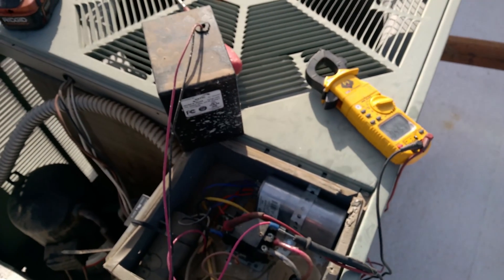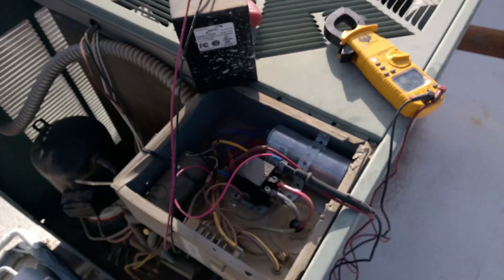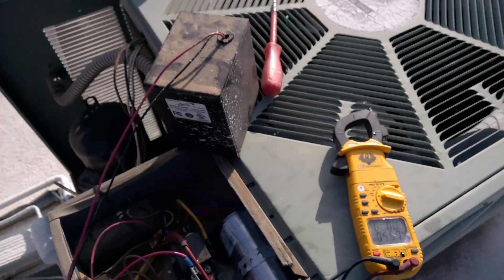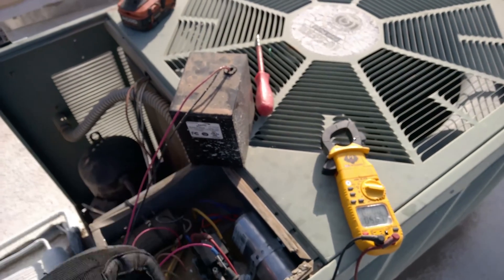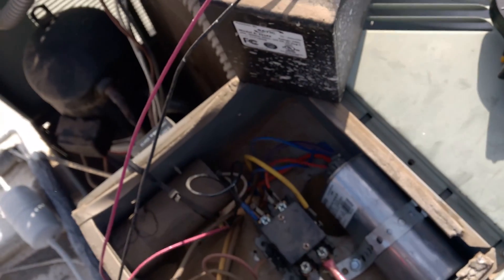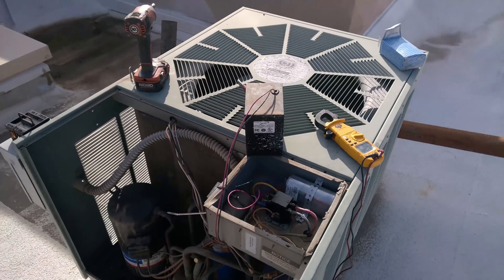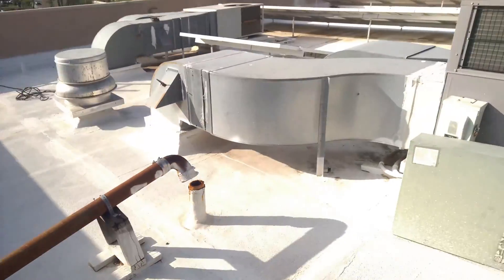Now another thing I did, now that I'm back here to finish a repair, is this thing that I was kind of thinking was a power factor correction gimmick or whatever. I believe that's exactly what it is. I have my capacitor checker hooked up and it says it's about 56 microfarads — you're not going to get a reading like that across something else. So I'm pretty sure that's all it is. It's not that heavy, so it's probably some plastic-based pack of capacitors in there. It is in parallel with the compressor — not hooked up in parallel with the run cap just for the start winding. It's connected to the output of the contactor in parallel with the common and run winding. It is for power factor correction. Who knows if it's been tested or actually works, or if it was just sold as a gimmick.